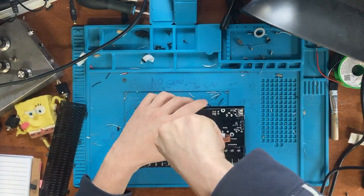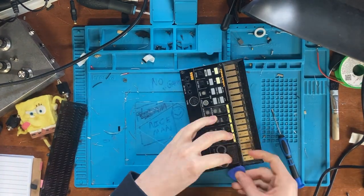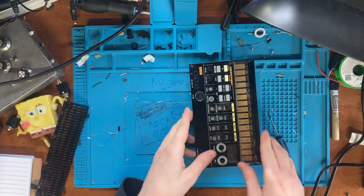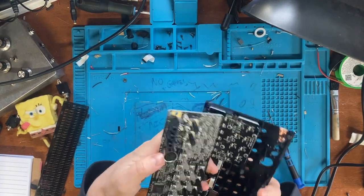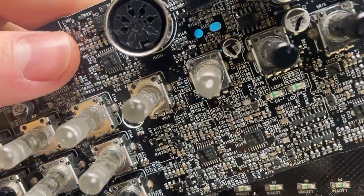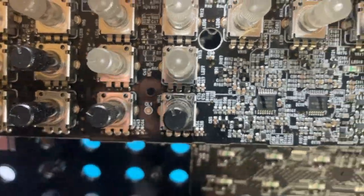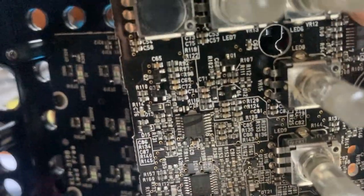There are a few more remaining screws on the PCB to undo - I've been putting them in the drawers at the top of my circuit board mat, which is really useful for not losing them. I accidentally broke the spudger removing the pot covers, because you need those to remove the front plate from the backboard PCB. For the first time now you can actually see C78, which is just to the left of the IC. I'm going to zoom in and point it out - there are two pads there which is essentially an empty capacitor slot which it appears Korg forgot to put in, or left off purposefully, which is pretty weird because it doesn't sound as good without it.